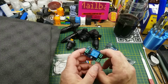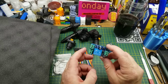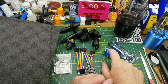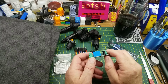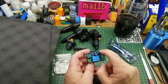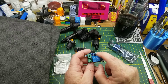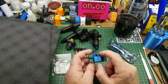Next, we had these two power switchover relay modules. I'm not quite sure if they're the same or slightly different than the one I previously got, but I'm hoping to test those out and experiment with them in the future. Thanks to Scott at DefPalm's channel for showing these in a previous video where he was modifying them to change the switchover speed. He discovered that they take a little bit too long to switch over because the internal power supply capacitor, I think it's this one, took a little bit too long to discharge and drop the relay out. So he dropped that a little bit, which as a result, you might get a little bit more ripple on your DC power supply, but not enough to cause problems.